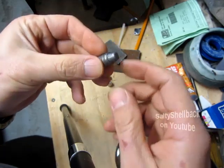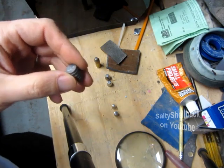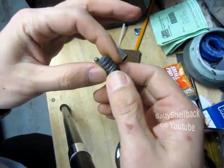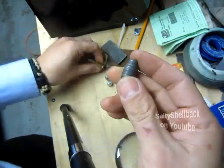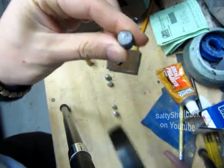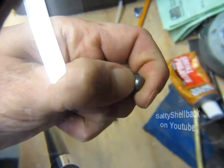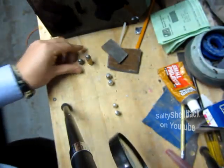Here's one of the bullets that I cast that I didn't load, and I heat treated it. They told me the heat treat was 350°F for 45 minutes. So I let the oven temperature go up to 350, waited and got the lead up to 350, and quickly shut it off at 45 minutes. Here's the result — it discolored a little bit, but same thing. I can run my thumbnail and you can see there are lots of thumbnail marks. Apparently 350°F at 45 minutes didn't work.